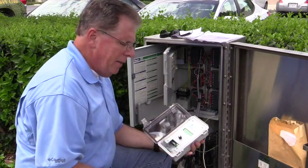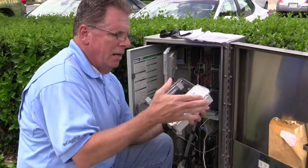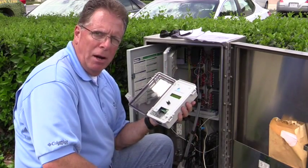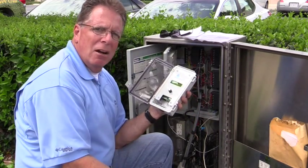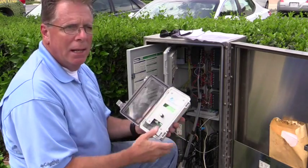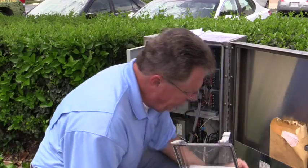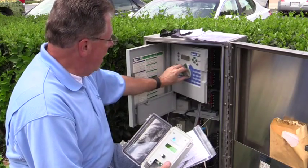What some contractors are doing is buying the hermit crab at a discount from a distributor, then invoicing the client at list price. They use the difference between list price and what they paid as their installation labor. So if you're buying it for $750 and it has a list price of $900, that's $150 you can put toward the install. And if you've ever seen a hermit crab go in — after you've done one, it's a 15–20 minute install: mounting the hermit crab in the box, hooking the Hunter cable to the Hunter controller, and turning the clock back to the off position.